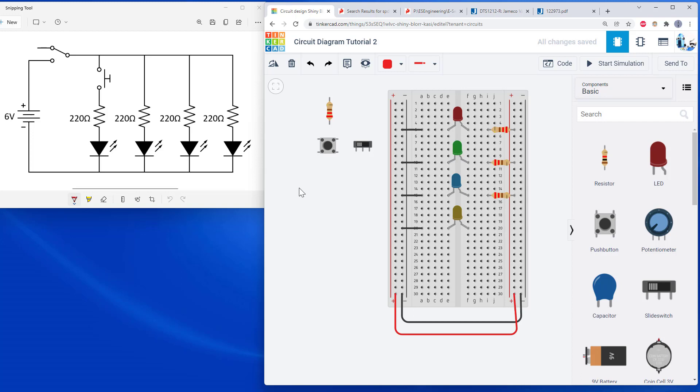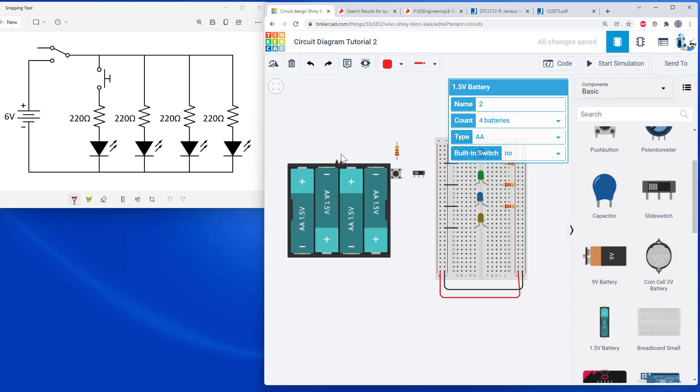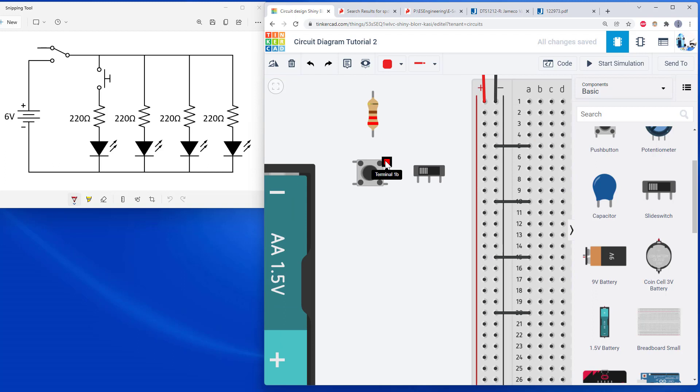In the previous video I had a battery pack connected directly to the power buses — the negative wire to ground and the positive wire to power. But in this circuit diagram, I have an extra switch connected to the battery pack, which lets me turn power to the circuit on and off. I also have a button in series with one of the LEDs, giving me additional control to turn that LED on and off. The button and switch have multiple pins, so it's not as simple as the two-pin resistors and LEDs.